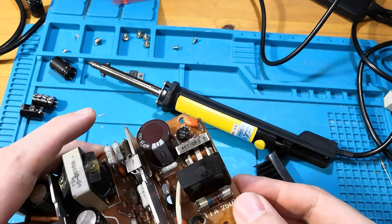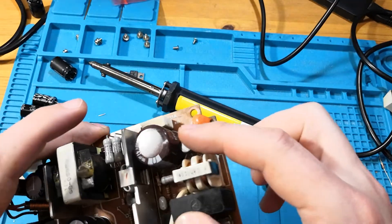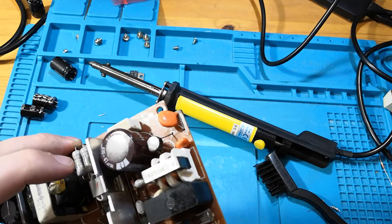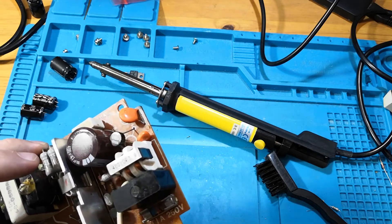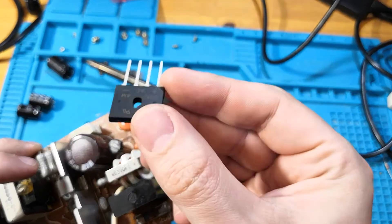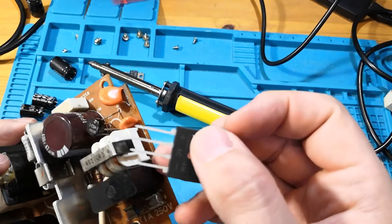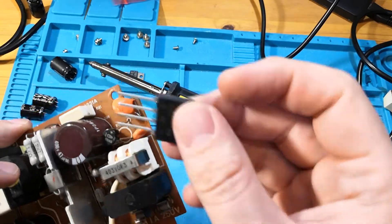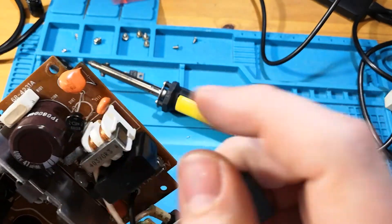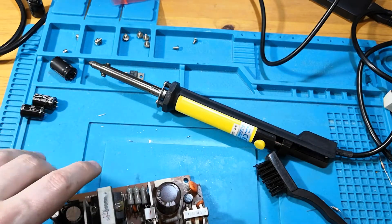Now we've come to a bit of an interesting part. Here's the bridge rectifier, which is quite a low-powered one. According to what I've been reading on the kit I've bought, I need to replace it with this, which is a 10 amp bridge rectifier. It's just a different shape — that side spreads into four, this is in a row. And also the hole's bigger. So let's get this off and then work out how to make this fit in there as non-destructively as possible.